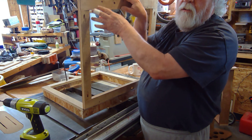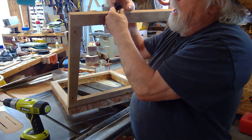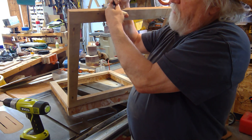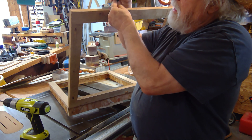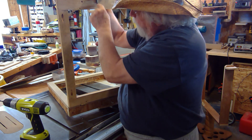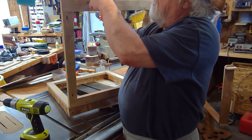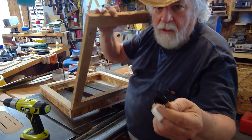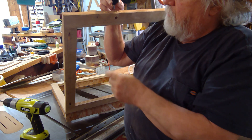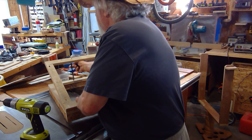As far as the set screw — pretty simple. It's just an insert and a knob with a bolt, cut to the length I need so that when it's all the way down it pushes against the rod to hold it against the bottom. That's all the lock screw is — just a little insert put in directly above this hole, and the set screw goes down into it. So this is the whole thing in a nutshell — it's not that hard.